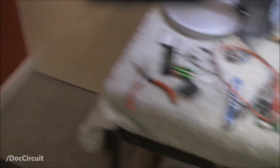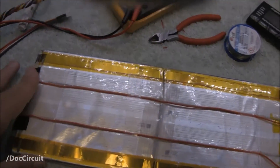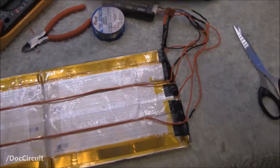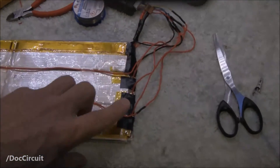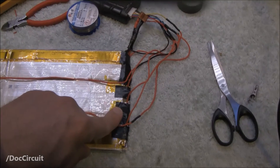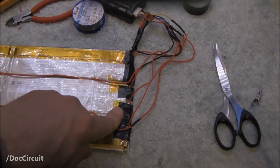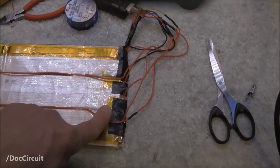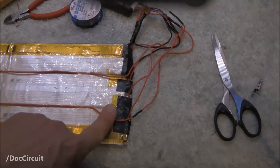Back to this. The taping I've just started and everything's going well. But I remembered something — the soldering of a lithium-ion battery: I did this, but don't do this. You shouldn't do this. Don't solder anything onto a lithium-ion battery.